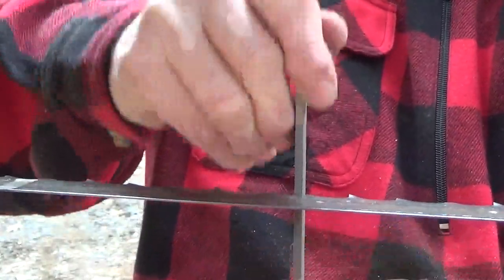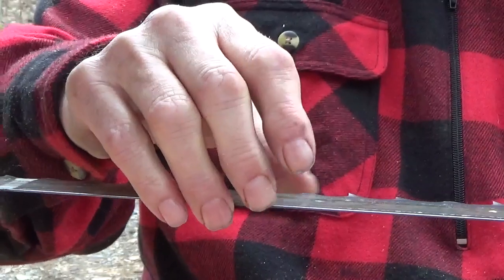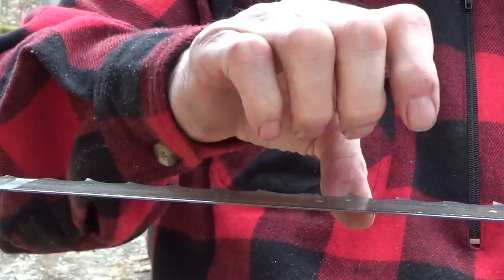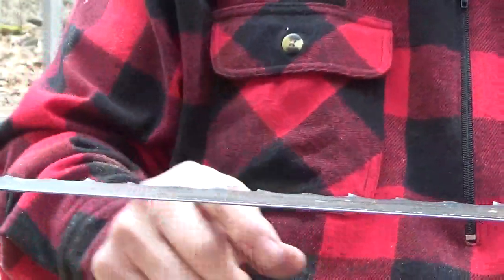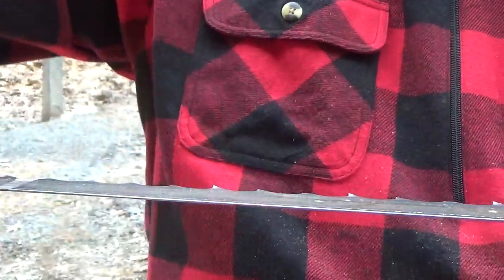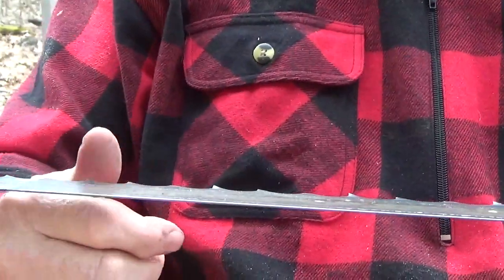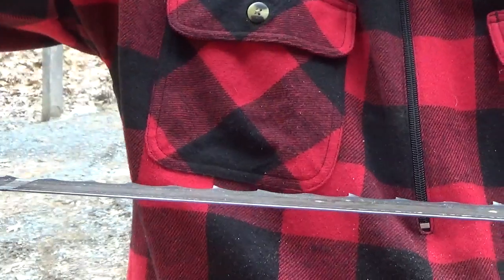Now you can see that it's big enough for a person to see, and that's as far as I've sharpened. And when I go across that, like this one wasn't sharpened and neither was this. Now they still have a little bit of grab, but not like this. Like, that is actually stopping me, whereas this one I can rub over it a little bit. I'm only doing this very lightly. So I have 1, 2, 3, 4, 5, 6, 7, 8 teeth sharpened, and you could tell it was only a matter of seconds. And then once I clean this up with this blade, I'm not doing enough to make the metal go around again. I'm just cutting it off. I just want it clean and nice and sharp. Okay, and that's all there is to it. That's what works for me.